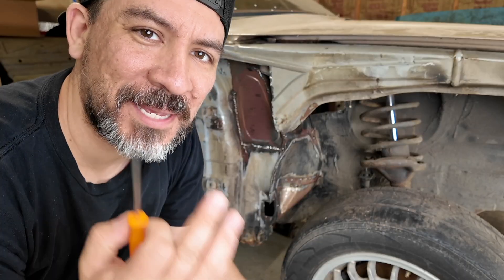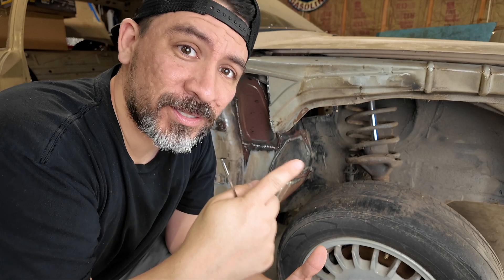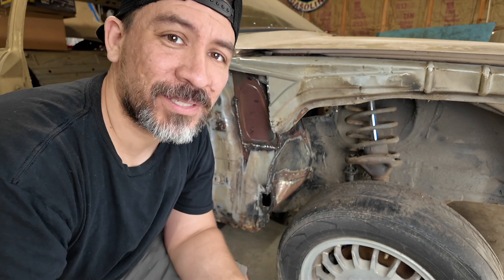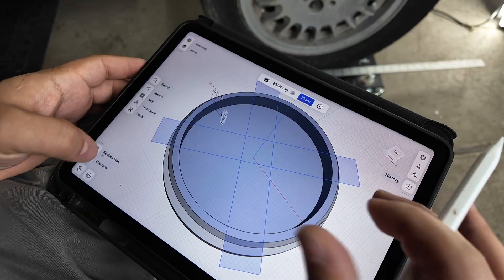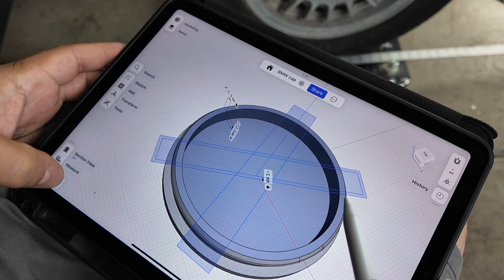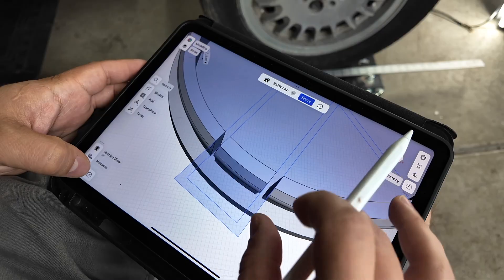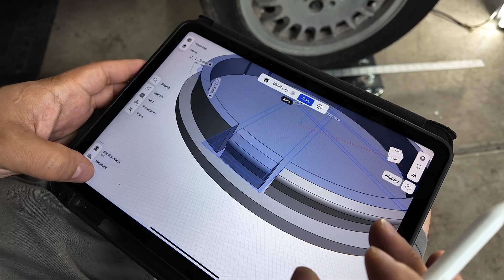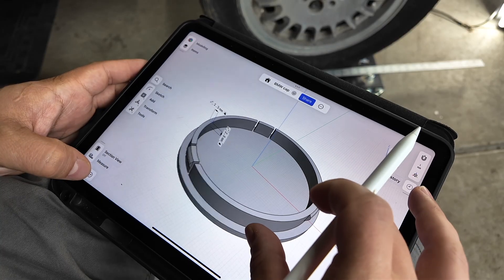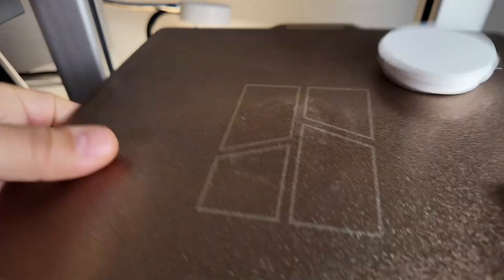That was a complete and epic failure. I should have been designing it from that inner diameter out, so let's rerun through that again and give it another try. After I increased the diameter of the circle, I also decided to add some clips around the ring for easier installation and removal. To do that, I added some rectangles with offsets to punch into the ring, and now I can remove the entire lip around the ring and just leave the lip in certain spots.